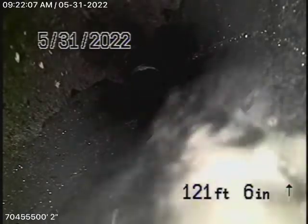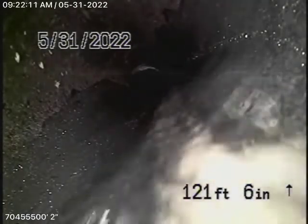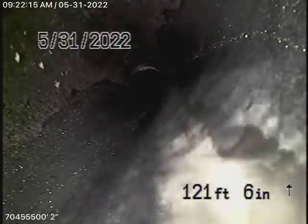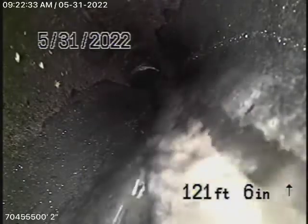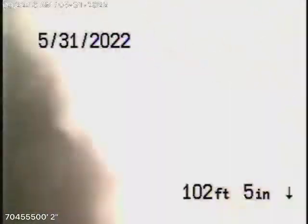It's been all ABS plastic running all the way down. The property line is difficult to determine exactly — it may be four feet or eleven feet from the curb, but based on looking at the neighborhood where they built a wall, I'm assuming it's four feet. You can find out from public works. Nevertheless, this is all ABS plastic, and whatever is exposed to the elements should be cast iron. What's buried underground here is all legal, in good condition, functioning very well, and has a very good grade going downhill.